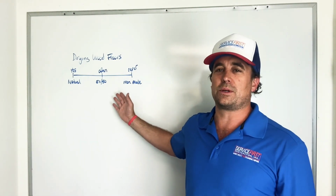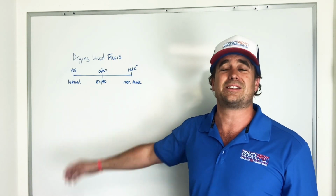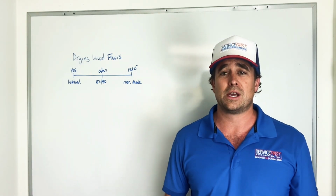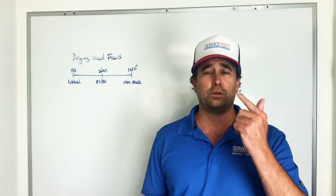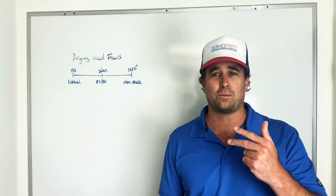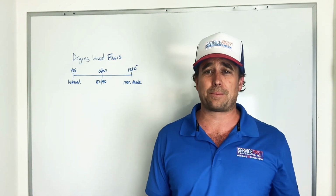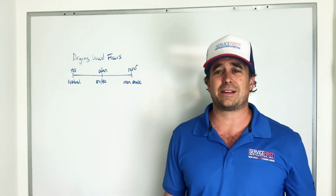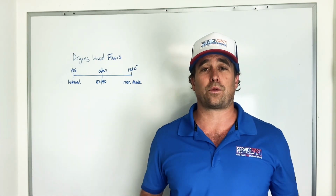Yeah, I would say often. We typically are going to be drying those in place about 60% of the time. Even at 60% of the time, it is cost effective to the property owner to dry those floors. Not just from the drying expense, but also the repairs, also moving contents. Many times if you're removing floors, you've got to move contents out for the entire property. You might have to be displaced. The property might become unlivable. So it still makes economic sense to try to dry those engineered wood floors in place.